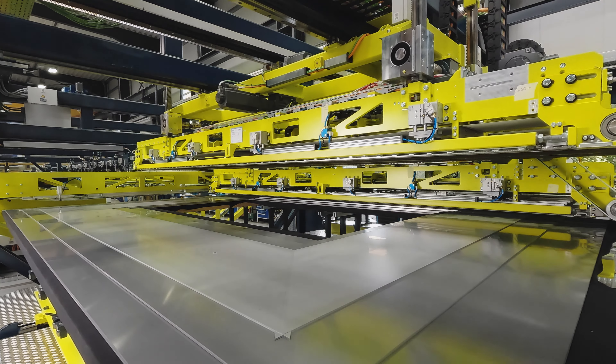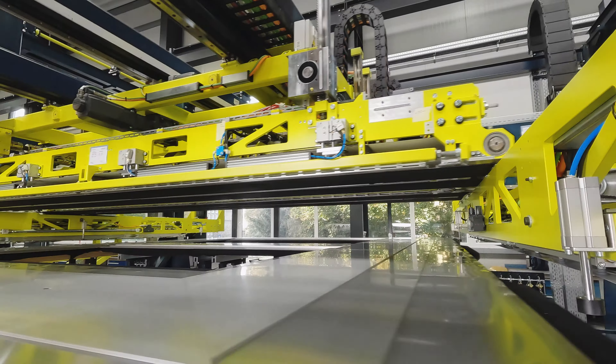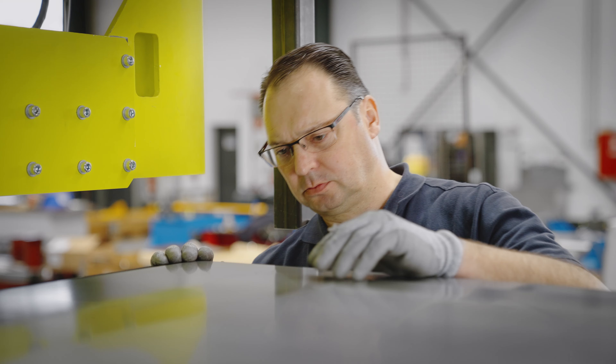The line with its automatic stacker gives our customers great advantages. No manual core stacking is necessary and labor costs are reduced. Automatic stacking creates repetitively good stacking quality and reduced core losses. No intermediate handling and storing of lamination stacks reduces process time and space required.